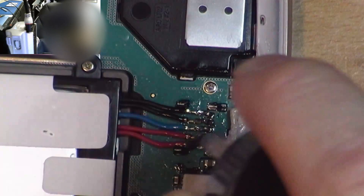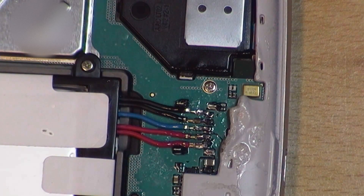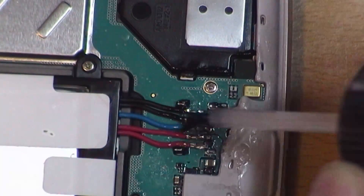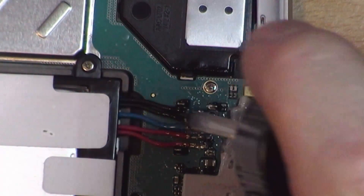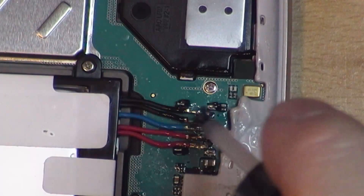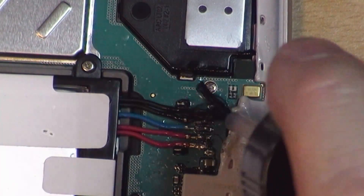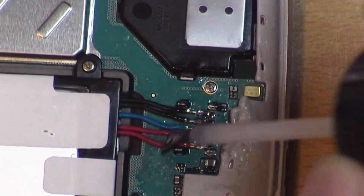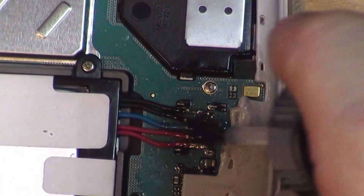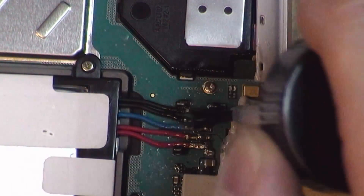The conformal coating that you can use — if you're not using this one, you can use something else. With the brush, I'm able to get in between the cables. With the pen it would be a bit more difficult because of the size of these cables. This is basically not for waterproofing like you see some other people using it for on YouTube — this is to stop the electricity running between the wires. It's non-electrically conducting, so we're okay on that front.